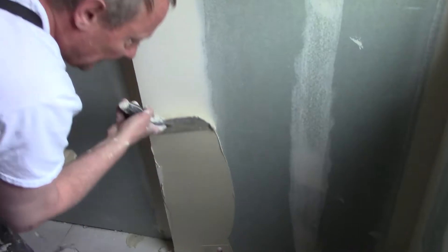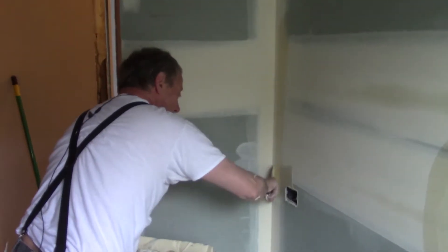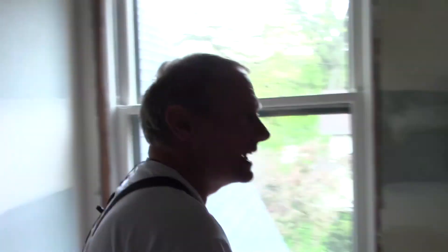Let's look at this one right here. What I'll do is come up to it and put this thin mud on like this, and I'll make sure all of it is covered. I'll flare this edge, and then I'll just walk away and let it sit, let this dry up a little bit. I can do other things — I can cross off all these lap marks, do a bunch of touch-ups. I have to touch up these angles too. So I just walk away for a minute or so and let that set. Then I'm going to get right behind you here with this corner bead too.